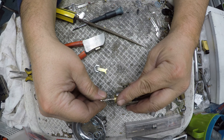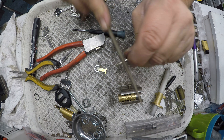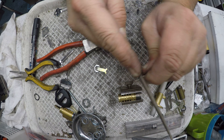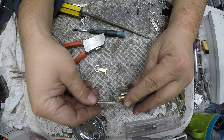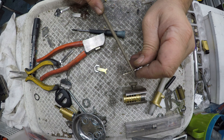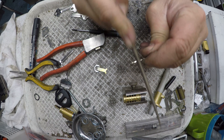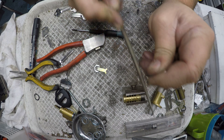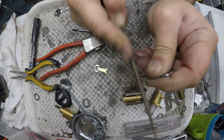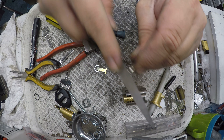That's our key now. We will have to fix up some of the ramps, but we're getting closer. This is called an impressioning file. We've only got a couple more depths to do. Normally I'd be using a vice to lean up against, but if I do that you can't see it. Just checking none of our lead edges are going to trap this key — and this one here looks like it will, so I'm going to fix that.